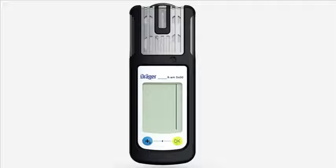The self-test screen shows the installed software version, the special symbols, the number of days until the next calibration, the alarm threshold for each gas, and the TWA and STEL alarm thresholds.